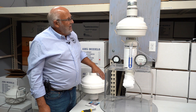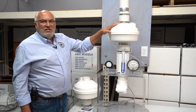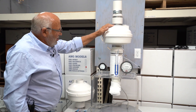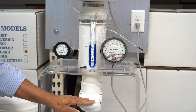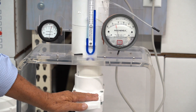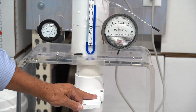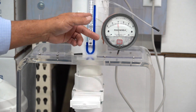Now we're going to show you what double stacking actually does. This is our workhorse, the Eagle. All of you that use FESTA fans know that the Eagle's certainly been a life-saving fan. So we're going to turn it on, look at the manometer, and see if we can max it out with our valve. We've got the valve closed — we're duplicating what's going to happen to a very powerful fan when you have no communication. This Eagle fan is capable of four inches of water column.